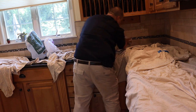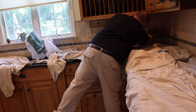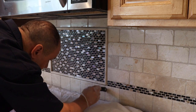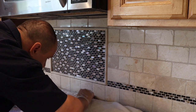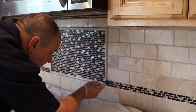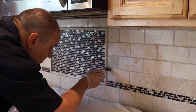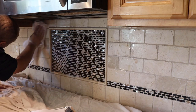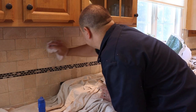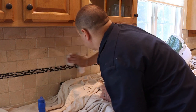One other thing I personally like to do is give those grout lines around the stove and the sink some extra love and attention — they are in the kitchen stain danger zone. So I take a small foam brush and really coat those danger area grout lines extra, then wipe them dry after five minutes. If you get any kind of streaking, just reapply the sealer to that section and wipe it off immediately, and that should fix most issues.